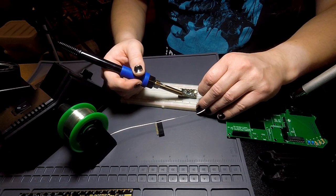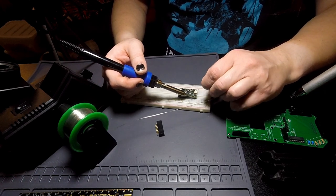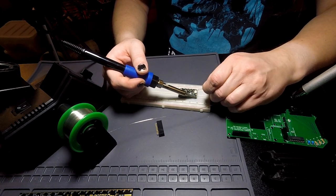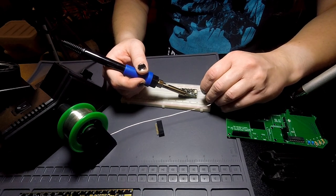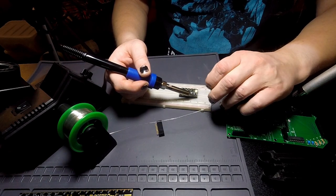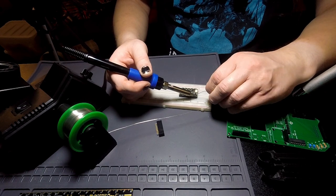The GPIO expander was very straightforward. I mean, you saw how I hooked that up. It was a single nice through-hole chip and 5 passives. 3 of which might not even be required. Actually, all of which probably aren't required, but best practice, might as well do it.